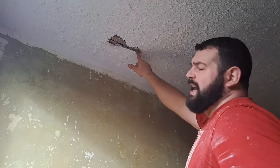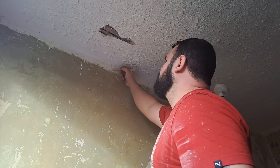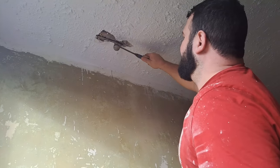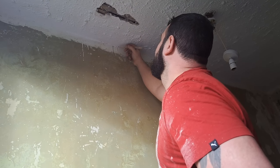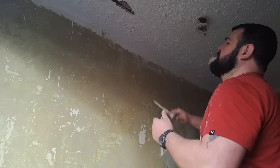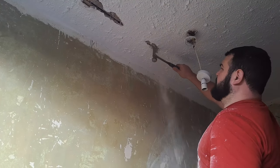We've just chopped along and found a nail in the lath, so I know behind that nail there's going to be a joist. Take your pencil and mark it on the wall — not on the ceiling, because once the plasterboard's on you won't see it. If you can find both sides of the joist, that's even better. Once you've found one, find the next one, measure them apart, and you'll easily find all the others because they'll all be roughly the same distance apart.